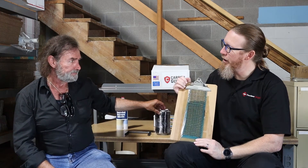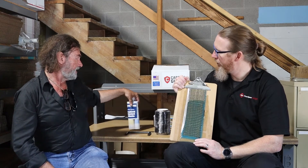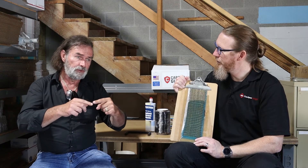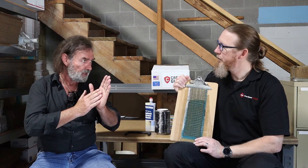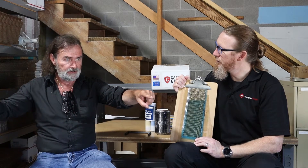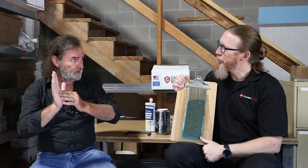That could be a hydraulic cement, or we have the 1200, which is a thickened epoxy — you want something with high compression. We also want to seal all of our cracks, because those can become a hinge. We don't want to use caulk, and we don't want to leave our cracks open, because when we go through a drought, the wall can move backwards.